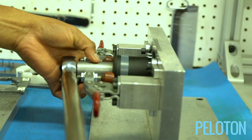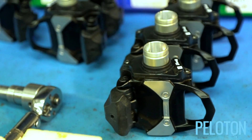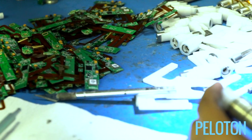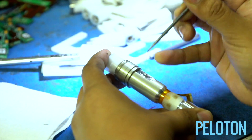You would think the force measurement would be easy — just stick some strain gauges on a piece of metal and measure force. Sounds pretty easy, but it's not. You have all these ancillary forces that you need to cancel; you only want to measure torque with the strain gauge. You don't want to measure bending, side loading, rider weight — any of those signals should read zero. Only the torque should read a value, and that's really the challenge.